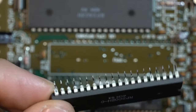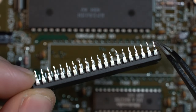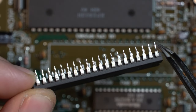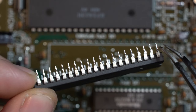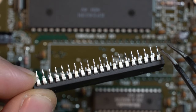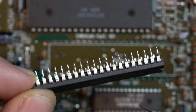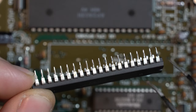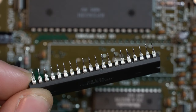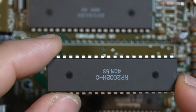If you have pins that are stuck, again, grab your tweezers, get on the pin on the backside, give it a little wiggle. If it's stuck to the via, you can apply new solder. You can use your desoldering station to pull it out, or you can just use a soldering iron and try to break it free with some heat. But don't fight it, don't tug it. You can damage the board, you can damage the PPU. But what we just experienced right here, that's a rarity.